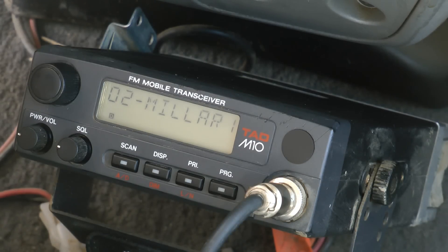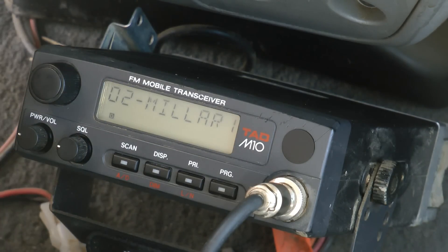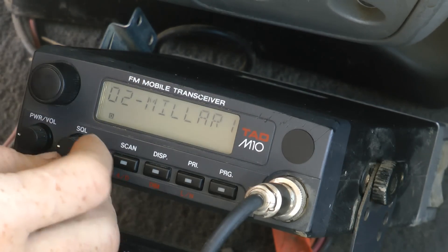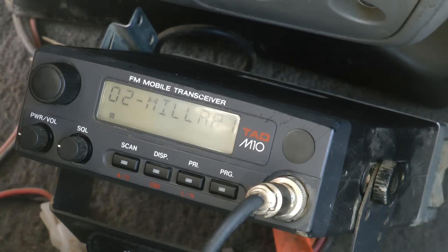The thing that matters most, that most people don't understand, is how a squelch button works. This is so critical if you're out in the woods planting. Not all radios have a squelch button — if you have one without, that kind of sucks for you. But basically, squelch is a way of adjusting how sensitive the radio is. If you're tree planting and you want to hear people from as far away as possible, you want to set your squelch so that it has the most sensitivity — it picks up the faintest conversations.